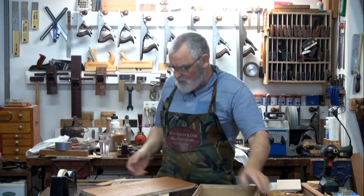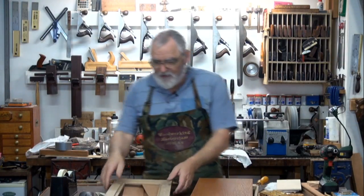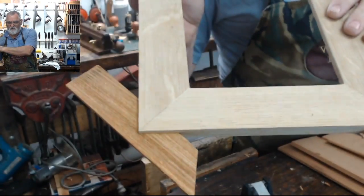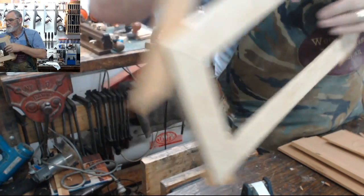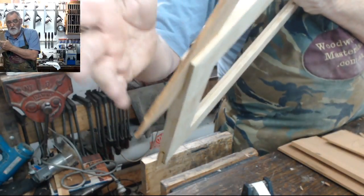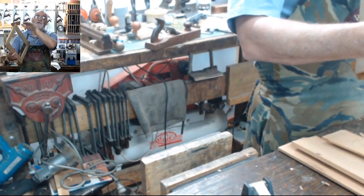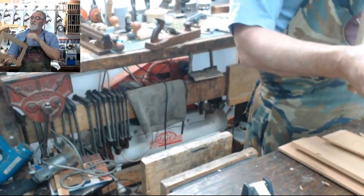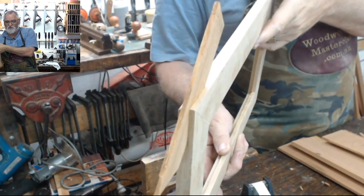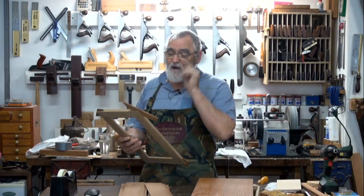Now what I did on the door, because the door is much more substantial, and as I said, it's going to suffer more impacts, I put heavy bits of timber in there. And that was just running this door over the table saw. You could have used quite easily an ordinary saw with a 1/8" chisel, or whatever size chisel you've got, and then you cut the timber to the size of the slots that you cut. Okay, I'm going to cut these off, then I'm going to shave them. Yeah, well, I'll plane them flat.